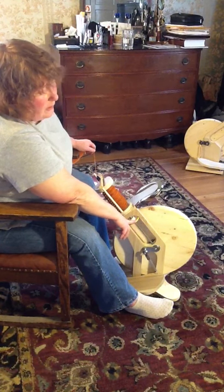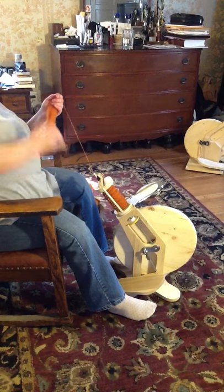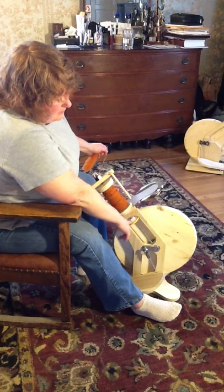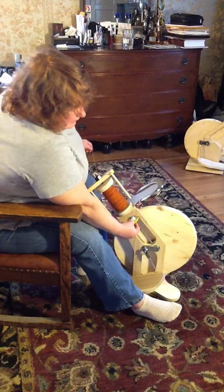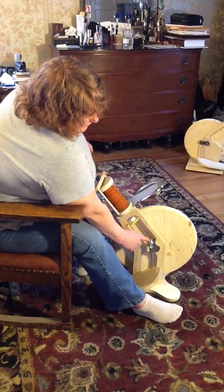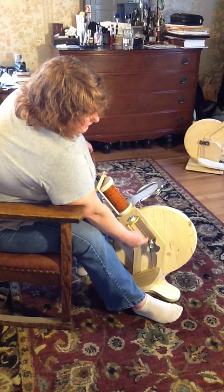I'm going to go with a 1-inch diameter drive wheel, which will change the ratio. I have my cheat sheet over here — that's going to be 11.5 to 1 on the highest ratio and 4 to 1 on the lowest. The highest ratio would be with the drive wheel all the way up at the top position, like this one is now. For the lowest, you would loosen the set screw and slide the wheel down the shaft as far as you can go — to where the crank connector won't hit it. So that would be your lowest ratio setting with the drive wheel in the down position.